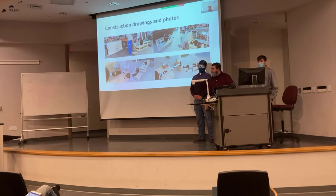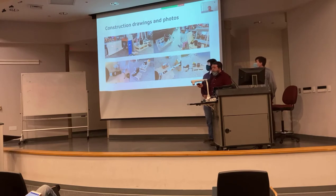This is a timeline of our build process. Starting in the top left with raw materials, then the test bench and the five-gallon buckets which hold the sea strainer. After that, we started laying out the piping system and figuring out placement of the bucket — the length needed to have all our sensors and fittings in line with each other. Those are the quick disconnects I mentioned earlier — a gator clamp with two levers that clamp down to create a watertight seal so we can swap buckets between designs quickly.